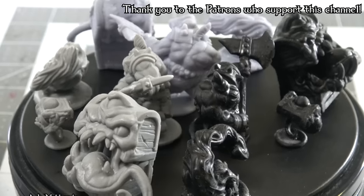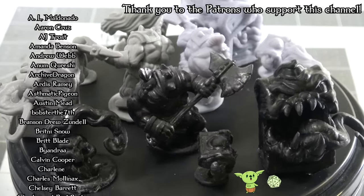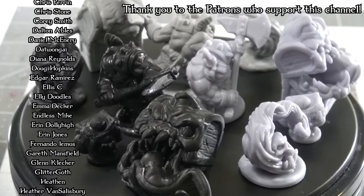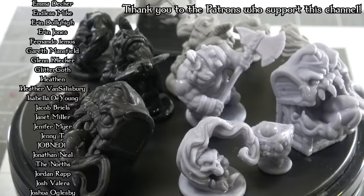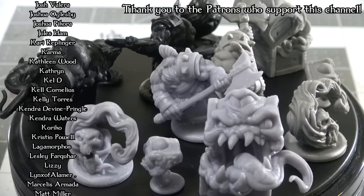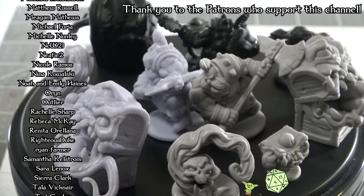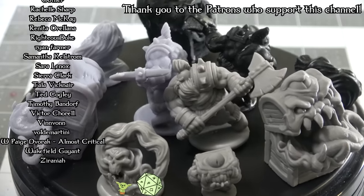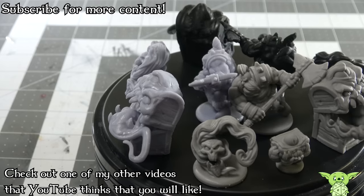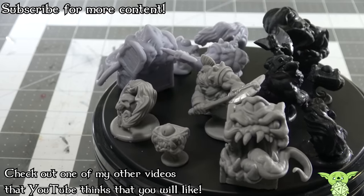So hitting things with a hammer aside, what can I actually say that I learned from all of this? I would say I wouldn't use water washable resin for things that I needed to sand, like creating masters that you're going to recreate with actual tabletop resin later — I would instead use alcohol resins like the Amerilabs or the regular Elegoo Mars resin. However, I would totally prefer water washable resin for miniatures because convenience is the most important thing to me. If I were to say would Amerilabs be worth it, I would honestly say no — high quality resins aren't that worth it if you're an average hobbyist. However, if you're a YouTuber, somebody who takes close-up pictures of their prints, or a 3D printer who sells things, I would definitely invest in the high quality resin because you get really smooth prints and they're faster than normal. But for the average person, you don't need to spend the extra money on it. It's the Cadillac of resin prints for a reason — the average person just doesn't need a Cadillac.